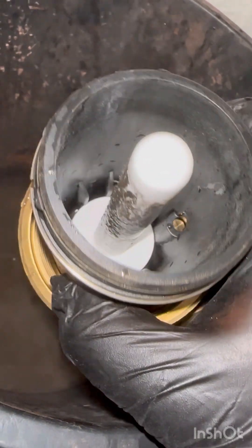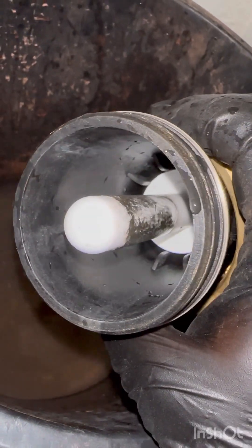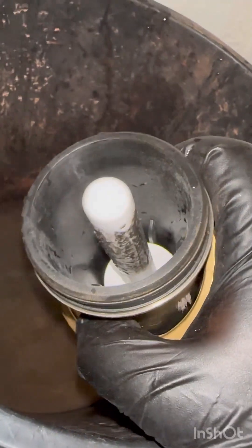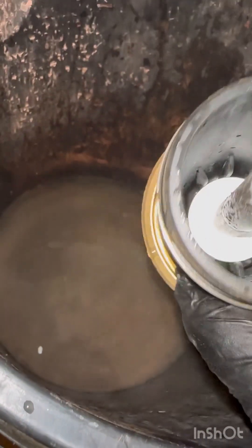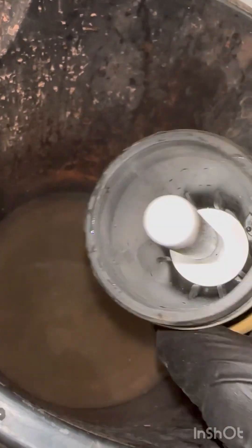And then here, there's all the magnetite out of the system. Never clean this out in a sink — always clean it out in your bucket, or take it to an outside tap. With there not being much on this, I'm going to clean this out in the bucket.